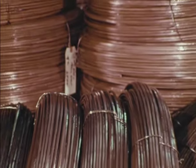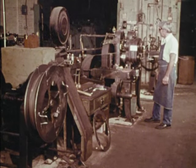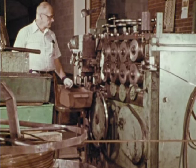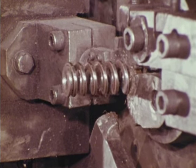Years of research and testing have resulted in development of the best cross-section for use in Raymond springs. It is rectangular with rounded corners. The shape allows the greatest amount of material to be packed in the smallest space and provides protection against fractures which result when stresses build up at sharp corners. The optimum material in the form best suited for the application is converted into the industry's toughest springs by specially engineered Raymond machine tools and the skill of experienced Raymond technicians. All of the many manufacturing steps are conducted under strict quality control, inspection and testing to protect the long service life that has been engineered into every Raymond spring.